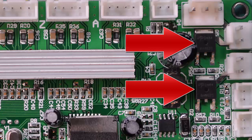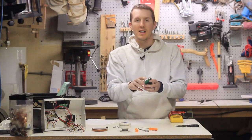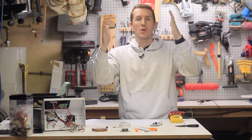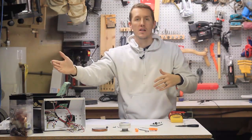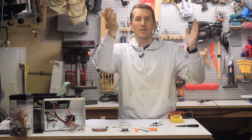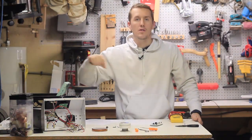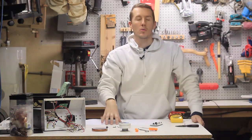Then I realized on the board there's two small switches - they're black squares with three wires coming off of them. I kept going deeper and deeper and realized those are called MOSFET switches. The way they work is like a switch: power is not going through until it's told to, and then it opens up. Your thermistor - say you set it for 200 Celsius - power is applied to the switch, it heats up until 200 is reached, and then power is taken off. It regulates that power, turning it off and on to maintain that temperature. I realized the power was always on - I had somehow fried that MOSFET switch.